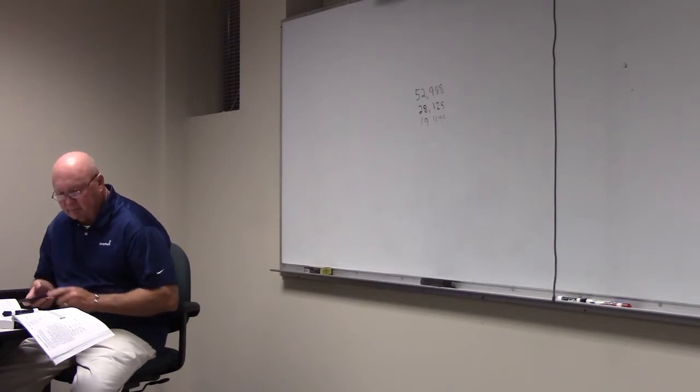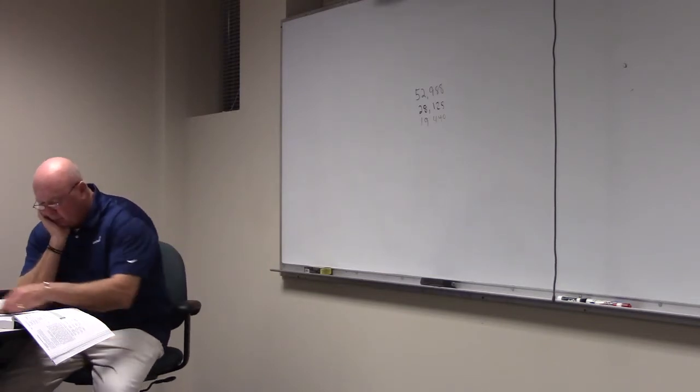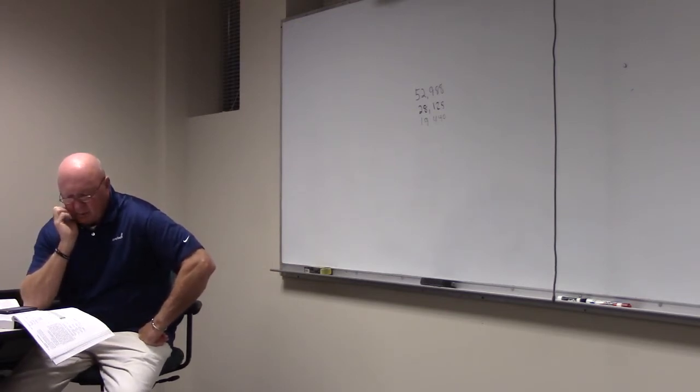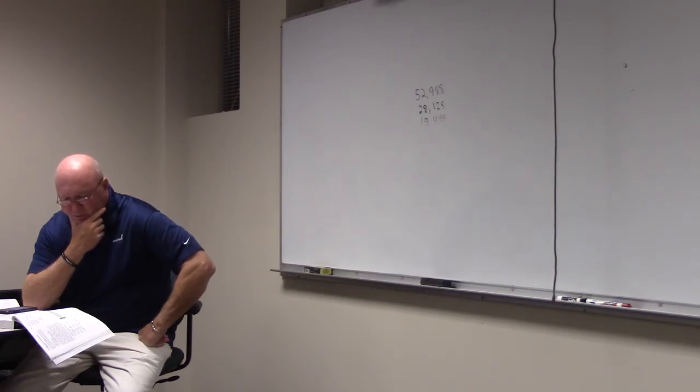So I disagree with them on this. I'm just trying to think how they would have come up with that. Well, let's see what the note says. It could be calculated using NEC 220.55 column B note 3. However, the value obtained, 54 kW, is higher, so column C was used.